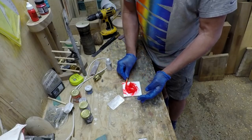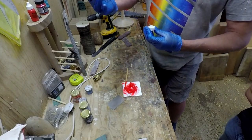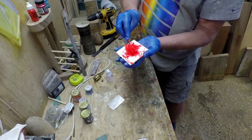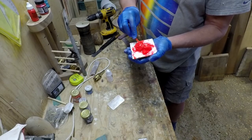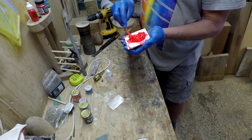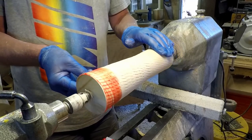I'm going to make a little hole in the mix and very carefully measure out the catalyst. That looks about right. This is the remains of the bottle that came with my last tin. If you put too much in, this stuff will go off very quickly. Working time depends on how much catalyst you put in — I've done some and it's still been soft a couple of hours later, and other times I've been halfway through and it's been stiffening up on me. The instructions say 4%. Try not to get this resin onto your lathe bed; if you do, get it off before it goes hard — it becomes extremely hard.